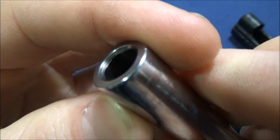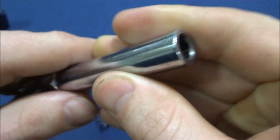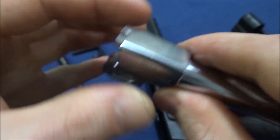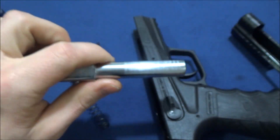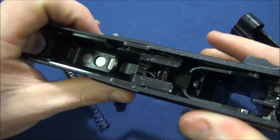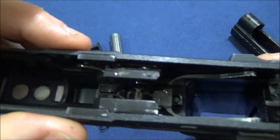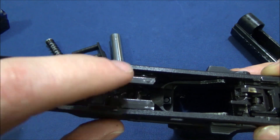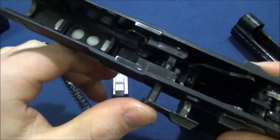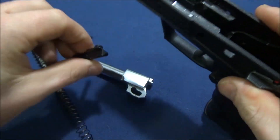The crown is one area I noticed was very unfinished and just ugly — the picture shows it better than the camera here. Overall this is a very good, solid, thick barrel — basically the same as the K2P or first-generation CM9. The internals use MIM parts, standard for CZ-style designs. You have metal rails connected to a block, and the barrel cams off that block in the same way as the P07.